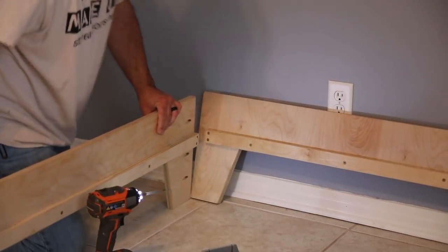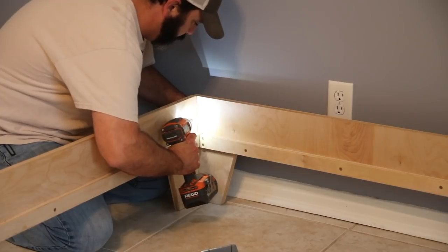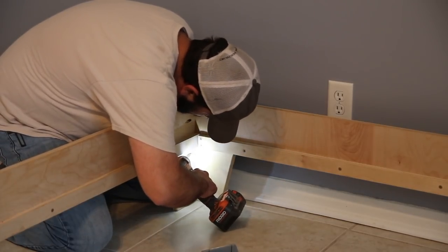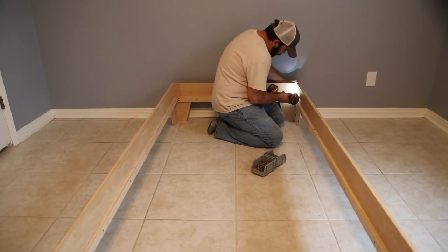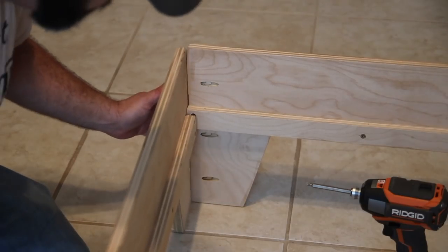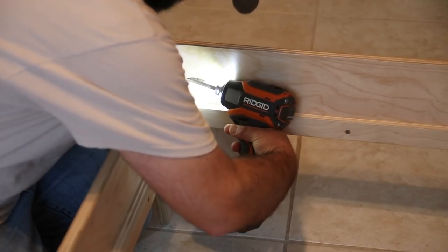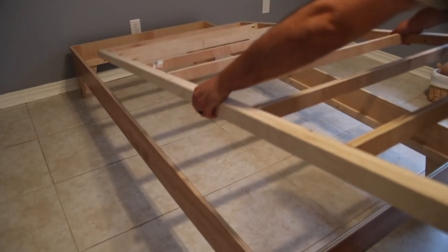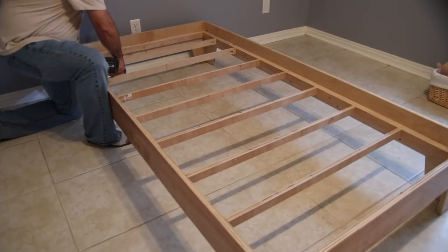This bed is truly a DIY platform bed — I've used less than two sheets of plywood on this project and cut everything down with a circular saw for the most part. I did use a table saw to cut some of my strips, and a jigsaw to cut out the legs, and now I'm using a drill. So if you have limited tools, this is a very doable project. These legs go together with three pocket holes — it's really easy — and with the support ledge on the inside of the bed frame, this is going to add a lot of support once you add in the lower support assembly.